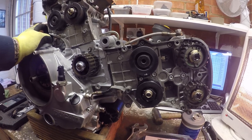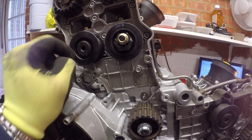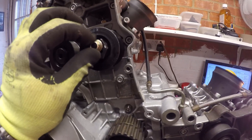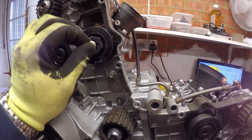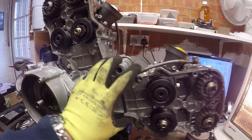Time to do the belts — just the last couple of pieces before we move on. We've stuck the rollers on, the fixed tensioner bolt is done up to 50 Newton meters, and the mobile is left loose until we get the belts on — same as when you do the Desmo quattro engines. That nut will get done up to 26 Newton meters when it's tightened in, so this side's all prepped for the belts.